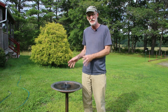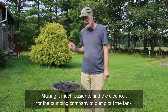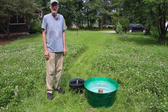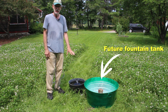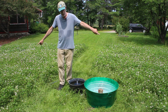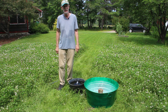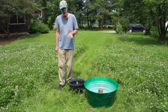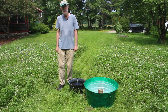So this serves two purposes for me: one, it's marking the septic system, and the other is purely decorative. The pipe from my septic tank goes out behind the camera over there. So I'm basically upgrading the fountain that I put here in the middle of my leach field. This is actually where the distribution box is underneath the ground, and I marked this spot with a paver so I would know where to dig if I ever need to access that distribution box.